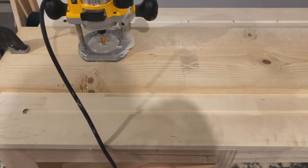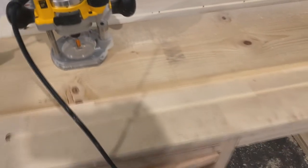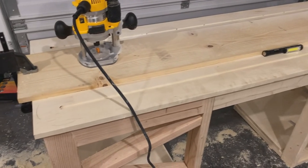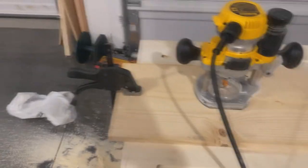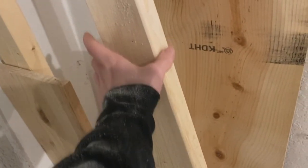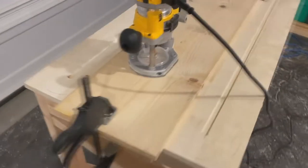Anyways, once you're moving in the right direction, if you're using a piece of wood as a straight edge and not a metal clamp, and I had to use a piece of wood because this is a really long desk, and I didn't have a 6-foot metal clamp. That's like $70 probably. So I was using a 2x4. And if you look at 2x4s, especially ones you just pick up at a hardware store, if you haven't planed it to make it exactly square, the edges are round.